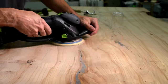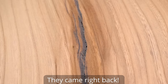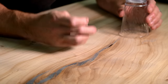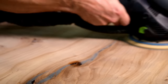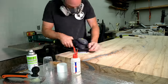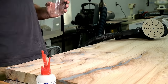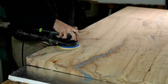One of the most frustrating parts of working with epoxy is filling these little micro pits — I fill them with CA glue, hit them with the sander, and then they come back. The solution is a little counterintuitive: actually make the holes bigger. Those little pits form an air pocket and won't allow the CA glue to penetrate, so I carve out a little groove, fill them with regular clear CA glue, and the clear actually matches the black epoxy just perfectly. Then hit it with the sander and those micro bubbles will disappear.